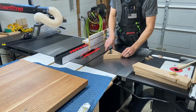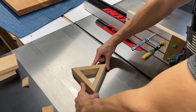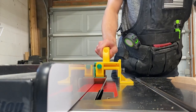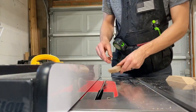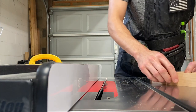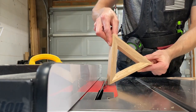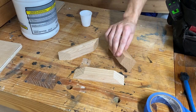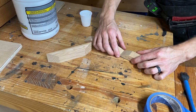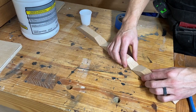Once all my pieces are cut, I put them together. The miters look good. Now I run them through the table saw putting that bevel on the front edge. I'm going to use the tape method to glue up this little triangle, and this will be plenty strong for this little test piece as well as the final lamp itself.